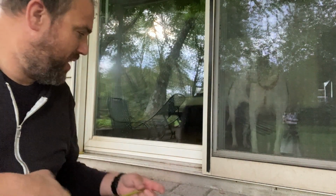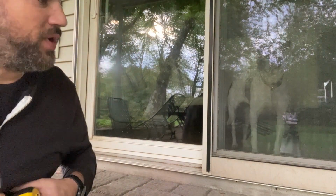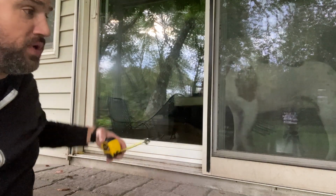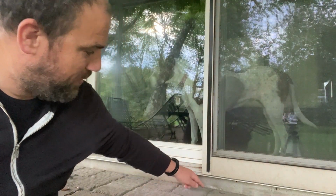I might need to come out. Yeah, I got about 1.5 inches, so I might possibly need to put 2 pieces of PVC back there, or at least some backers behind it. But the measurements real quick, I got 2 3/4 and 2 3/4. So actually I don't need to do any sort of scribing because I have a flat run under there. So maybe I go like 2.5 to accommodate the ability to slide everything in there, cut everything back, and that'll give me a little bit of a lip here.